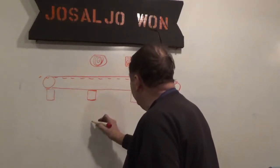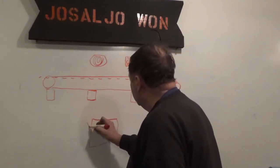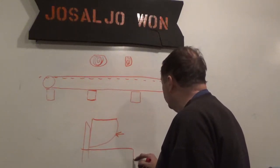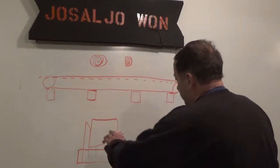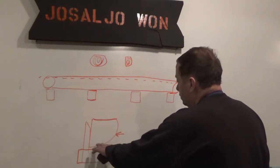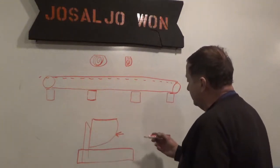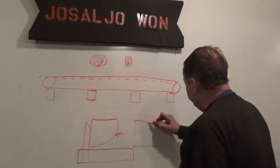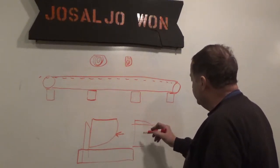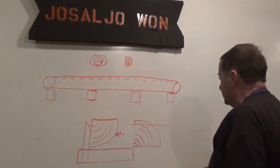I'm going to draw that bigger. Draw the same thing down here, just so it's bigger. So now you have this cut like that. You have the dog here, or I mean the adapter. You have your dog against this, and you have the bottom of your bunk rail. From here on in, as long as you use this side and this side to make your next cut, you want to roll this onto one of these flat sides. If you roll it this direction and we have this shape and you cut this, this is parallel to that and it's parallel to the bunk rails. Now this should not be a really hard thing to figure out, but it seems like a lot of guys get messed up over that.